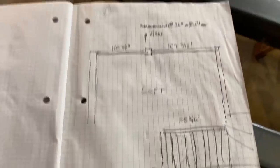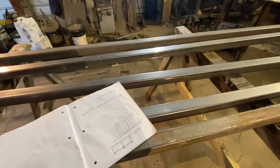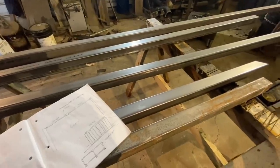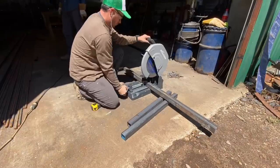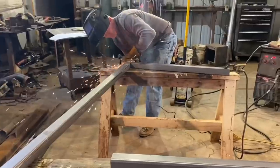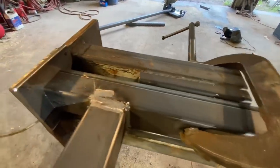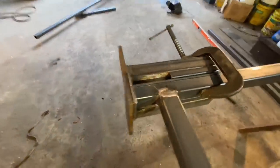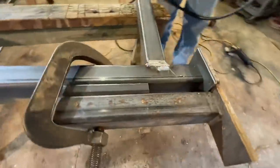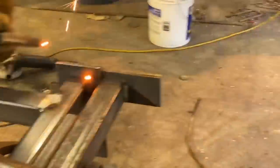The first thing we needed to do was get an exact measurement of the railing length. Then we took a little bit off, like 3/32 of an inch, to make sure it would actually fit when it came time to install. We made the outer frames out of 2-inch square stock metal. We assembled them and then used a really cool jig that Jaime had made a while back to attach the post bases perfectly centered on the leg. It only fell on my foot one time while I was unclamping it.